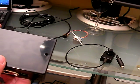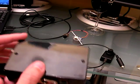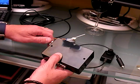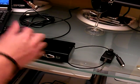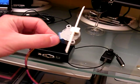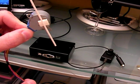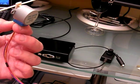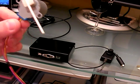I'll initially connect it without a USB connection to show the manual focus control. This is the little motor — it's a four-phase stepper motor with a 64:1 reduction gearbox connected to it. It's a nice little motor; it's only five volts, small and very light.